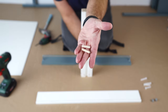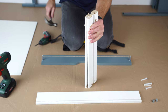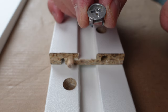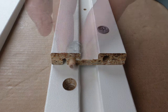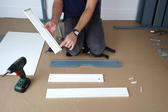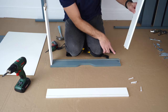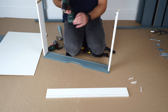Side panels: two wooden plugs, one for each side panel on one side. Now each of the side panels is going to have those smaller locks, and they have an arrow on one side. The arrow on the lock is going to point to the front hole on the edge — that rule applies to all the locks. Exactly the same for the second side panel. Now place them into the front panel so the gap on the side panel lines up with the gap on the front panel. Slide them in, exactly the same on the other side. Secure the connection by twisting the locks to the right on both sides.